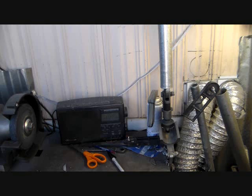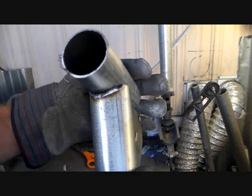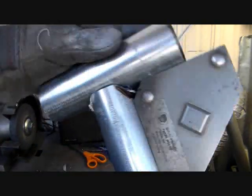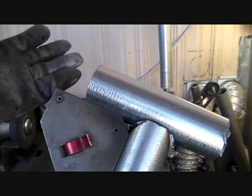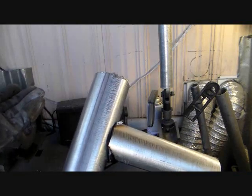And I have another video on my channel where I show exactly how this pipe notcher works. But if you don't have a pipe notcher, you can actually use a bench grinder. In fact, I just ground this one out. This took me a couple of minutes, and if you do it a couple of times, you'll get a little better at it. But if you're only going to do a few of them, a bench grinder is probably going to work just about as good as anything else.